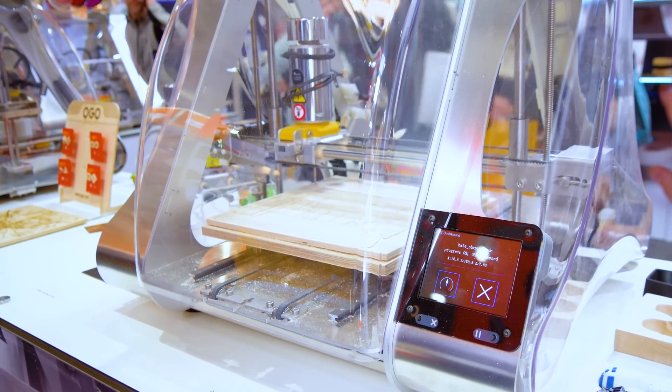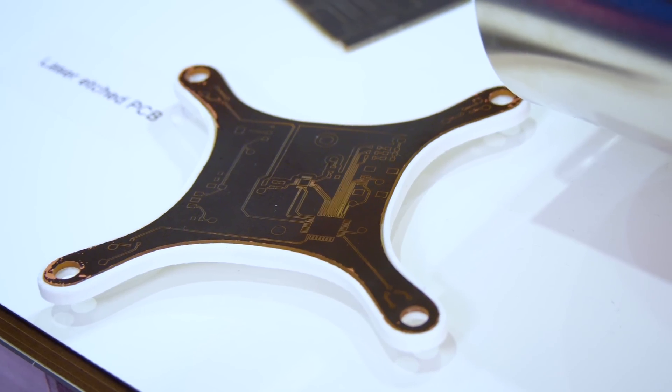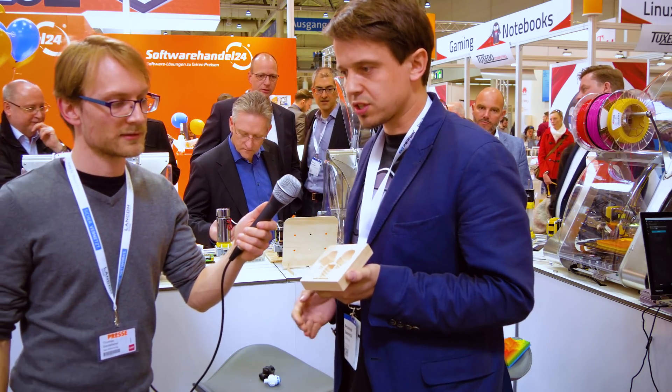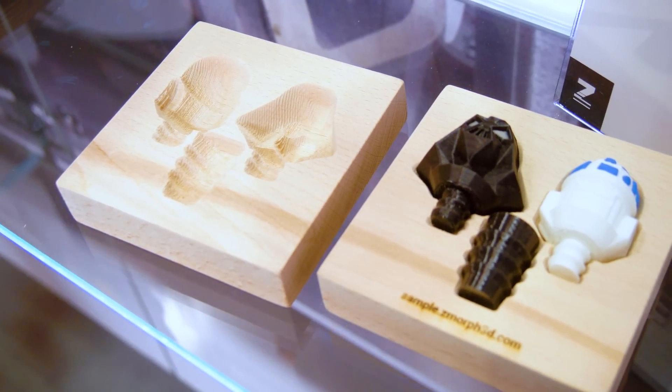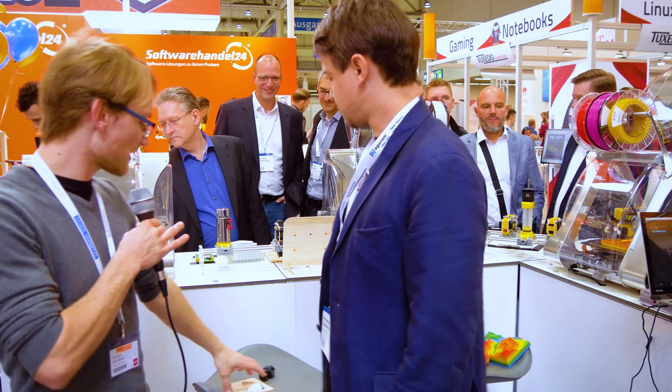Your main starting point is 3D printing, but let's look at the CNC mill actually milling something out of birch plywood. We've also got some PCBs — those are laser-edged with the outline cut. One of the most important things is that you can cut in 3D, so it's not just a 2D or 2.5D cutter. You can do full shapes, and you can use the same models used for printing before, using the same geometry. That comes from the concept of voxels in the software — you voxelize an object, process it, and use it for various processes, either milling or printing.